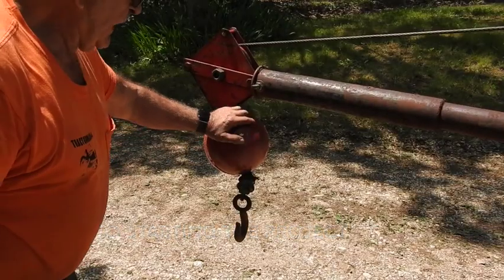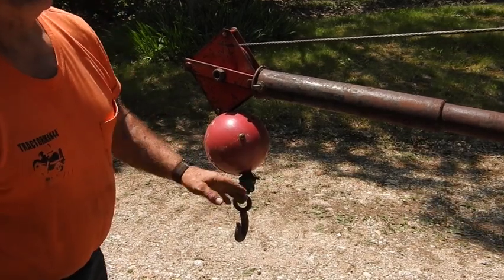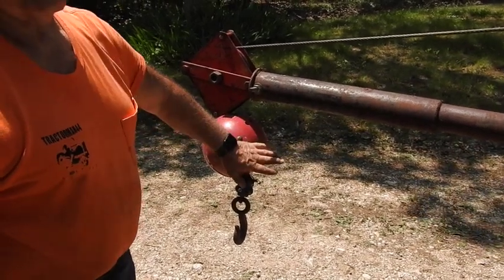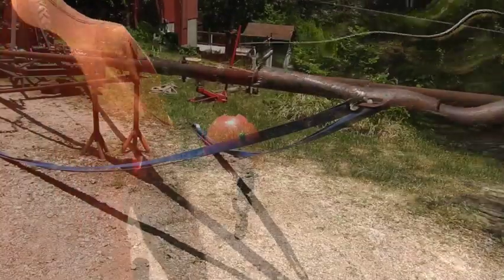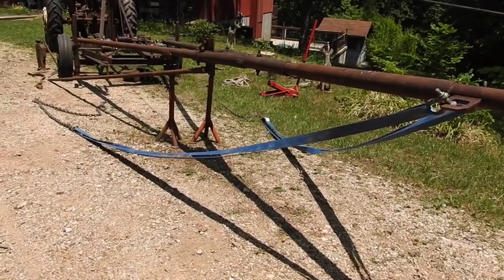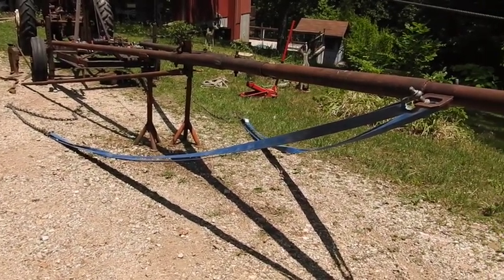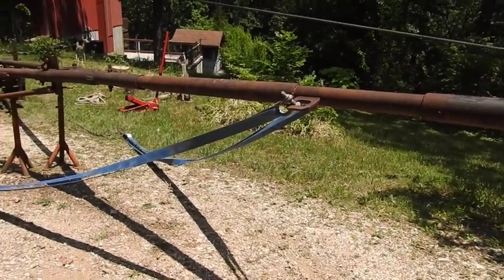We have a headache ball made out of a bowling ball — that's just to be able to drop the cable back down if we don't have a load on it. We can reverse the winch and let the ball pull the cable back down to the ground. Once elevated, we'll be able to use those blue straps and the chains and tie those off for triangulation, to make sure we have no stress or very little stress on the actual pipe.